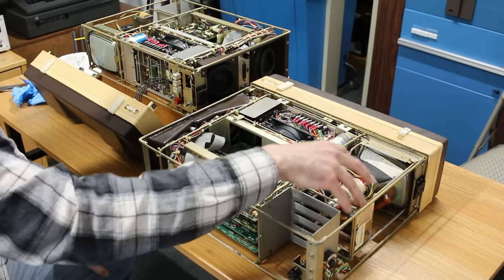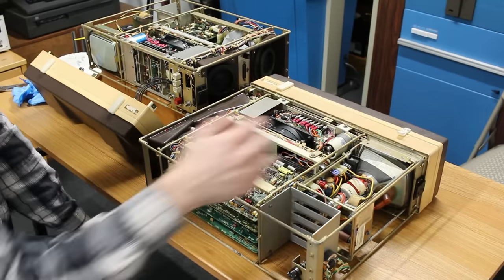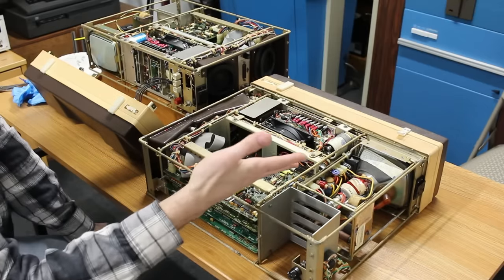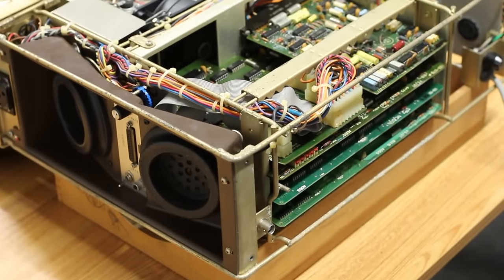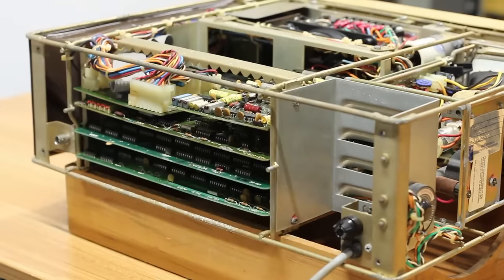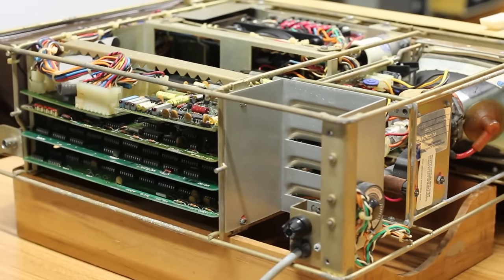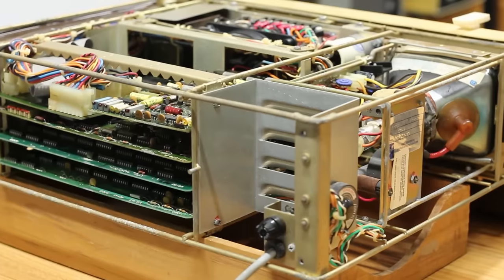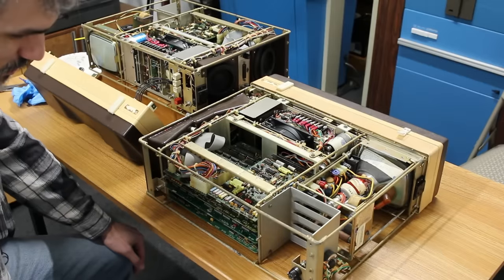And the CRT is just like a little separate thing that can pull right out. So I said, you know what, I'll just hop over to the parts machine and pop it out of this one. And when I opened it up, it was clean. There's no rat poop in here anywhere. I've spent the last day and a half swimming in rat excrement, and I didn't need to. All right, lesson learned. Check your parts machine first, because it might not be the parts machine. It might be the main machine.